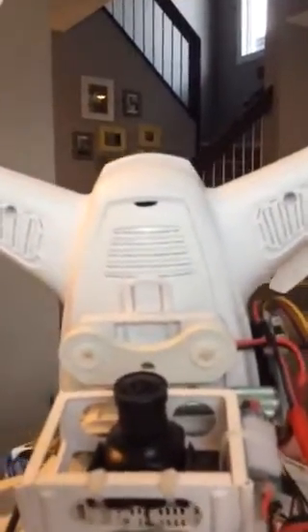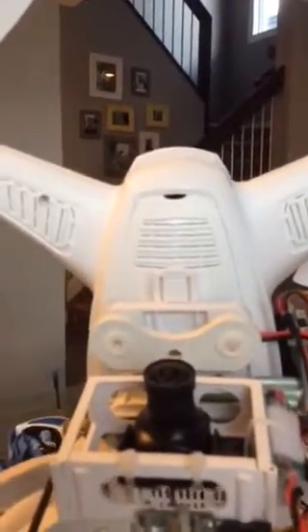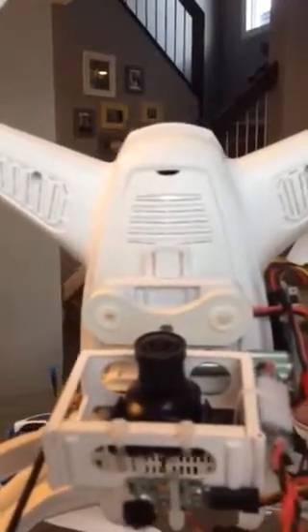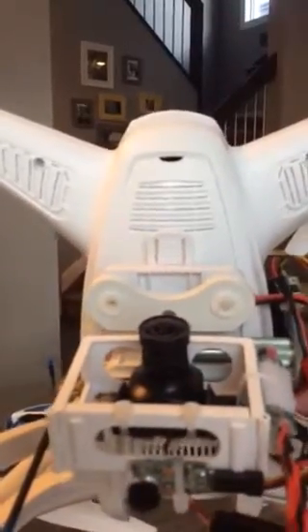As far as power is concerned, I did tap into the main power — probably not able to see it underneath this front panel right there that pops out. I was able to tap into the back of the plug post; I just stripped off the heat shrink tube and soldered onto the other side of it — it's almost like a Dean's connector — and then I used some liquid electrical tape just to tidy it up.